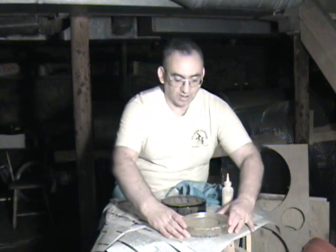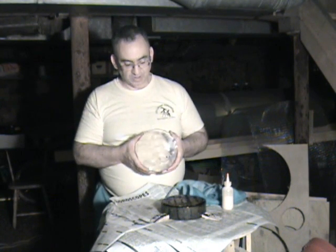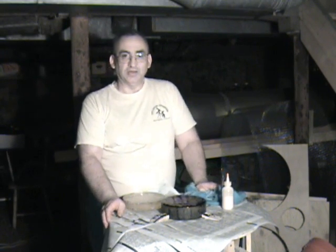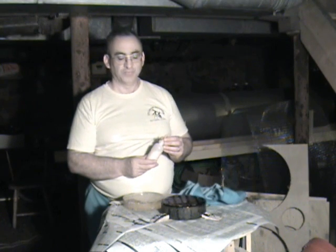As of my last tape I was working on polishing my fifth surface. I've now completed the polishing of my fifth surface in pretty much record time, and aside from splotches of pitch on the surface — which is just dirt — it's very, very well polished. I began my sixth surface, and after an hour of polishing I'm almost done. I'm absolutely amazed. Fine grinding through 3 micron using a soft pitch lap and number 85 rare earth optical polishing compound from Universal Photonics has worked wonders.